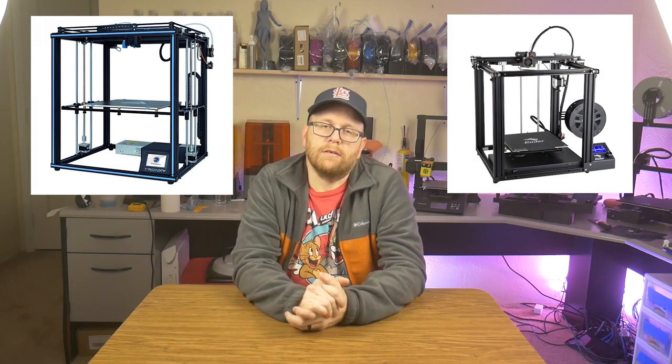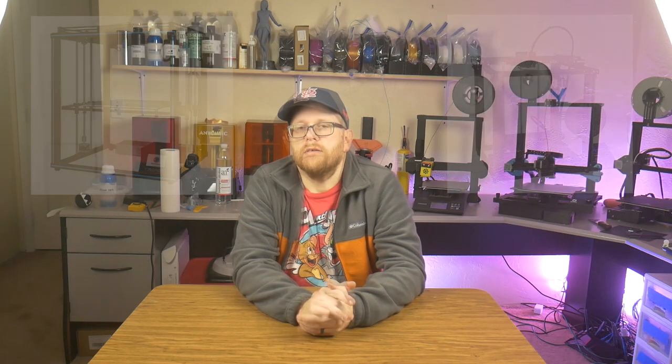That wraps up my quick recap of my three FDM printers. Now let's talk about my wish list for an FDM 3D printer. The more I print and the larger items I print, I'm looking for speed. When your Y-axis has to move a big heavy glass plate back and forth, you start to lose fidelity the faster you go. The solution is a Core XY machine like the Ender 5, or a company called TronXY that primarily makes Core XY machines. I'd love to get my hands on one and see how far I can push it.